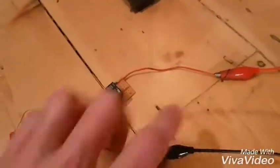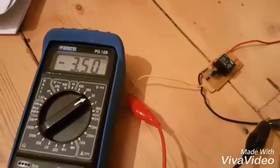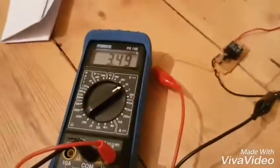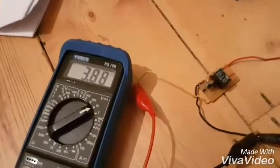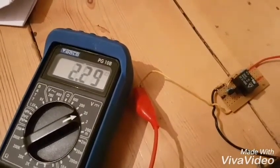It's a pretty simple setup: voltage in, ground, voltage out, ground obviously. To the multimeter, variable power supply — turn that on. 3.5V. There's no lights on it but you'll hear it click and you'll see the multimeter drop. I've actually got the wires in the wrong way round there, so let's just put that in the right way round. 3.5V. So I'm just going to basically crank up the voltage. There it goes — it's off, comes back on.